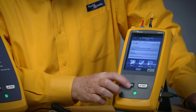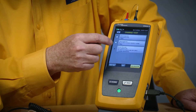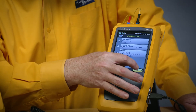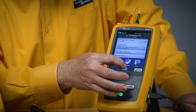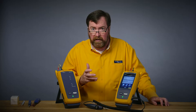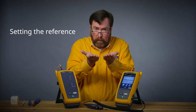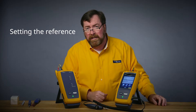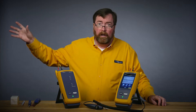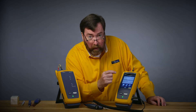So now I'm going to go to the home screen and switch from my fiber inspection test to my fiber loss test — doing smart remote, using an optical loss test set, an OLTS. Now when we're doing fiber loss testing, the first thing we need to do is measure how much light is coming out of the fiber. We call this setting the reference. Setting the reference is an extremely important step — if we do this wrong, our testing all day long is going to be wrong. That's why we want to do this with the one-jumper reference.